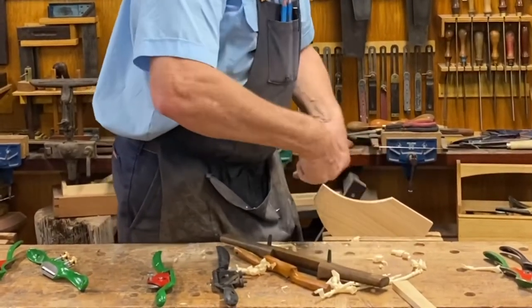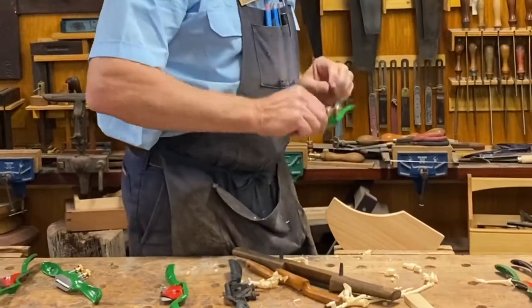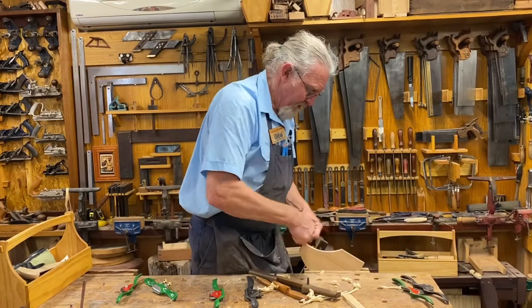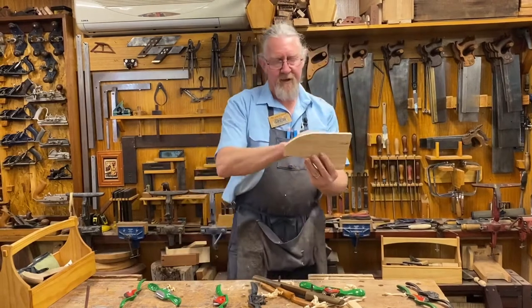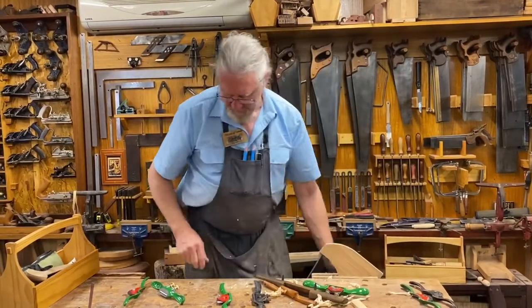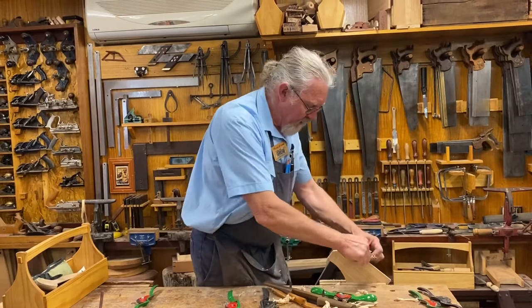It's very much a rolling of the wrist to get that just right. The curved-bottom ones are a little bit trickier because you've got to find that happy place where the blade is cutting nicely. That's working pretty well. When you've got an outside curve, you're much better off with one with a flat base.